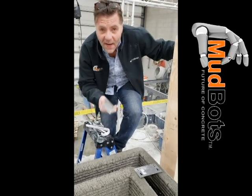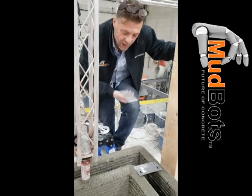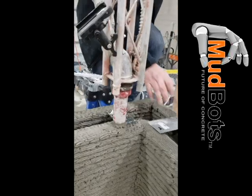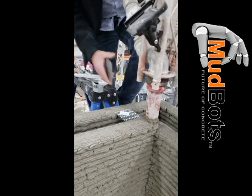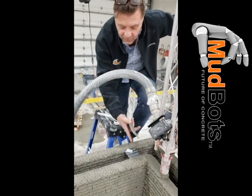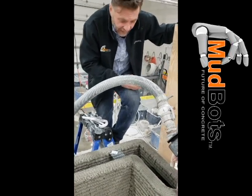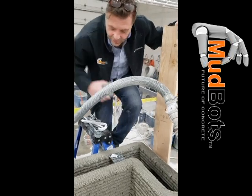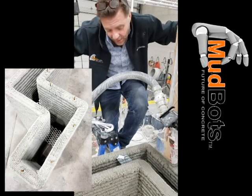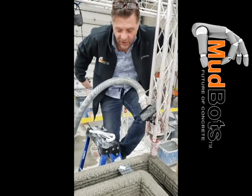Quite simply, there are five answers to every one of those questions. As soon as your engineer does some of the calcs, you'll be able to submit it to the building department. Here's one method: I can put anchors in every 8, 12, or 24 inches and screw through our two-by-six right into those. Another method is to let this dry, drill my two-by-six, and use screws with anchors directly into this.